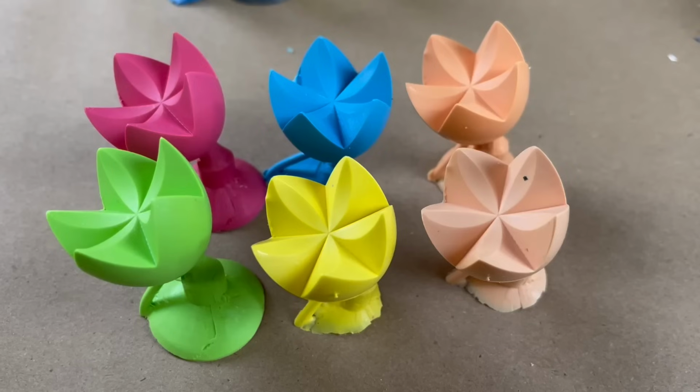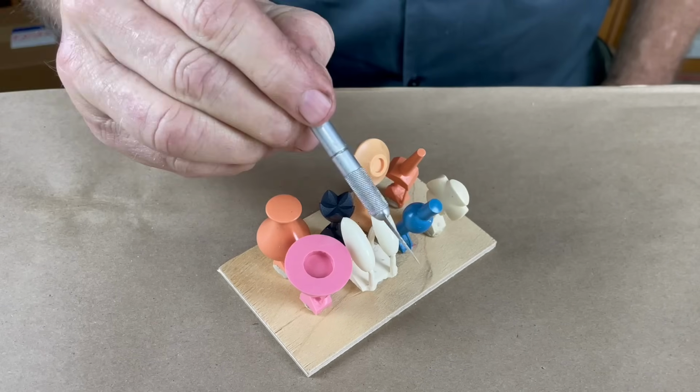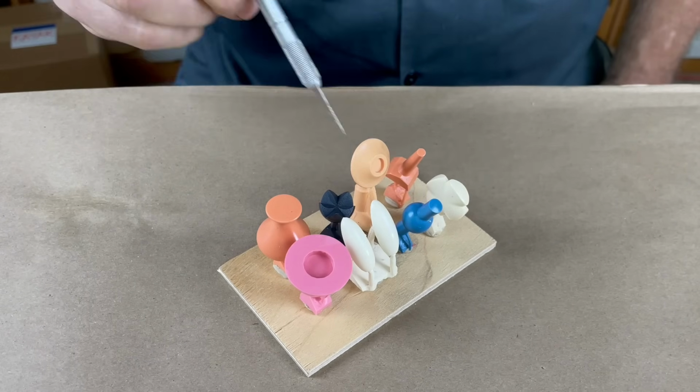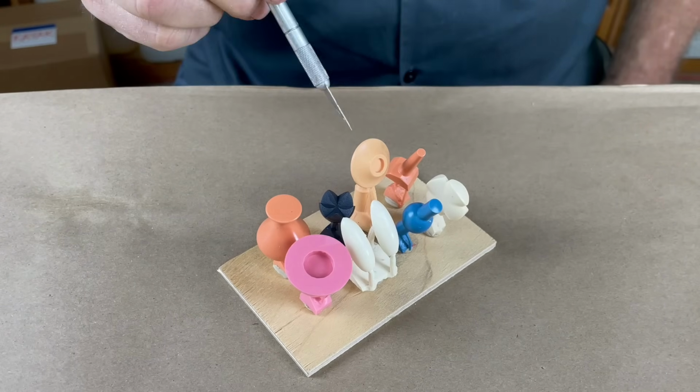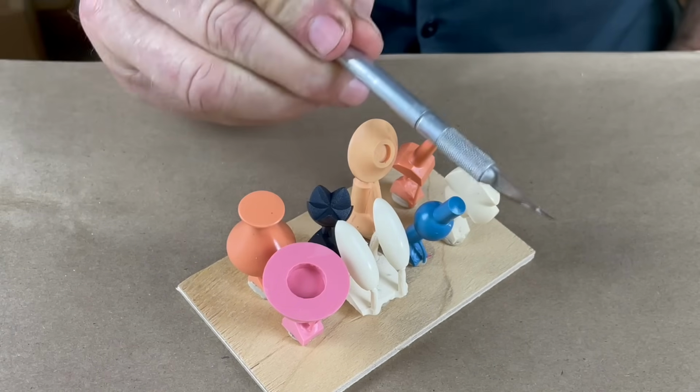But you have to be really careful when you gang parts in a mold. If all the parts are the same, you can orient them the same, and then you have a really clear prediction as to where your cutting lines are going to go. But if they're different parts, you have to orient them properly, number one, so they'll fill, but also so that when you cut the molds, you get a mold that reliably can be opened and closed.